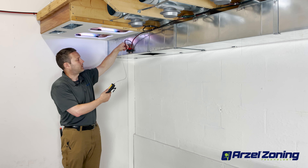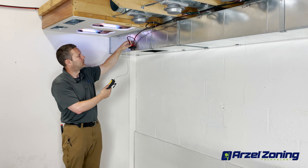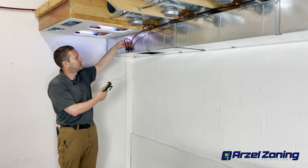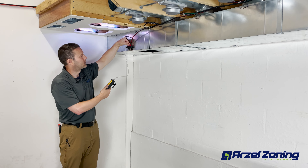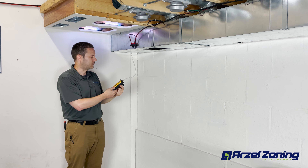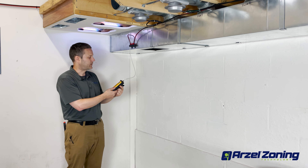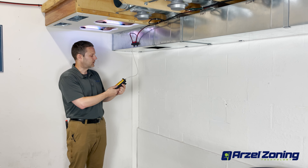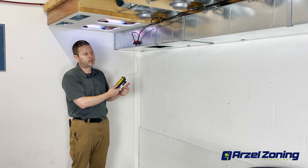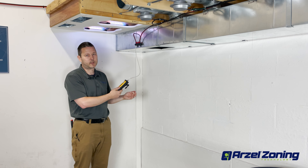It's possible maybe a mouse chewed on my Easy Hub. So I'm going to inspect my caps and see if any of those look like they're damaged. That one's got a small tear to it — looks like something was chewing on it. So I can move my manometer over to that port, reconnect this damper, and take a look at what happens. I can hear my pump noise changing pitch back at the panel. I can see my pressure climbing — still climbing — it's over 40 inches now. So I found out that I had a red cap on my Easy Hub that a mouse had chewed through, and I had a single bad damper.